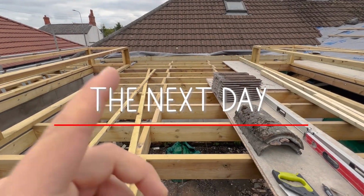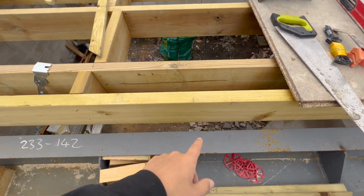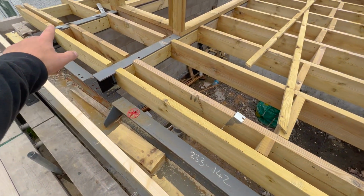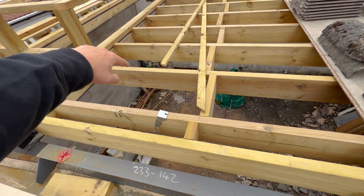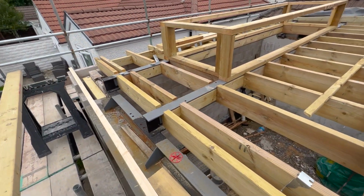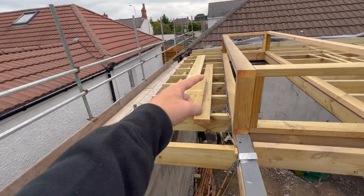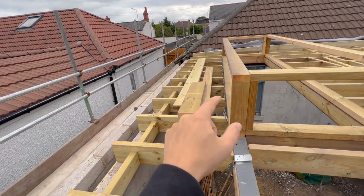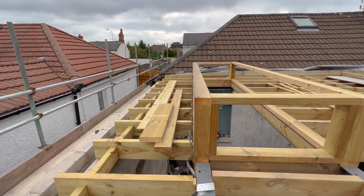Right, so I'm going to start the day by doing a centre furring piece from up there, sloping down towards me. That's the centre there, and then it's going to go from there and then slope down towards the corner there. So I'm going to do a bit of an angle there, so they stop as they catch on to the next pieces. It's all going to run off to that corner, and then once I've got this corner sorted, I can then work my falls out from the middle. So there's a high slope sloping this way and a high slope sloping that way from the middle outwards, so I can go to my outlet there and my outlet over in the corner. So that's the plan for today.